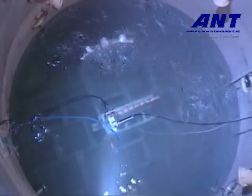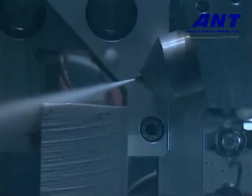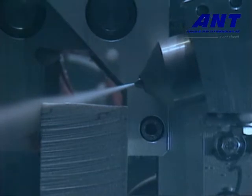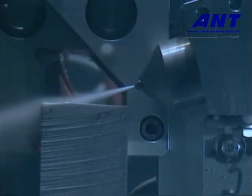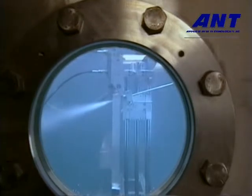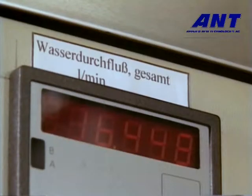We've been doing trials with this method in our test basin since 1997. We not only had to discover whether the hydrojet would actually cut through the steel, but also whether we'd be able to position the manipulator with millimetre precision. Then, how to hold the cut pieces firmly until they could be transferred into transport containers.